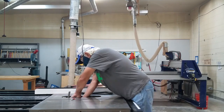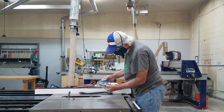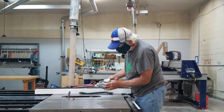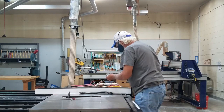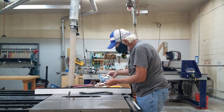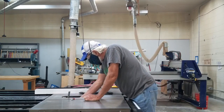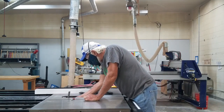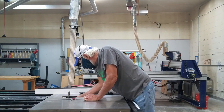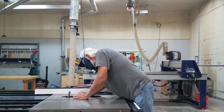This was demonstrated earlier in the video. The different radius on the brake cartridge will stop the saw. You won't be able to use the standard cartridge with the dado set because the safety system won't figure out that you've got a dado brake cartridge in there. Insert the key.